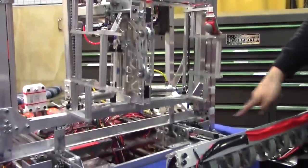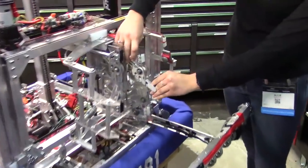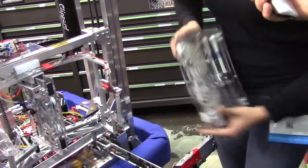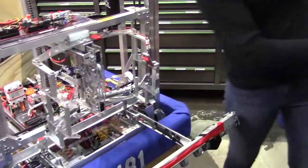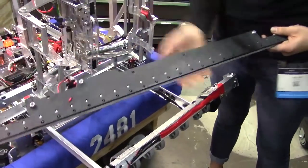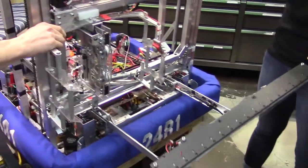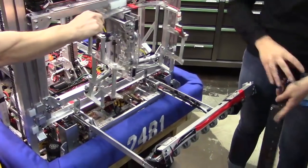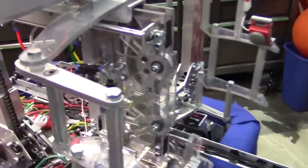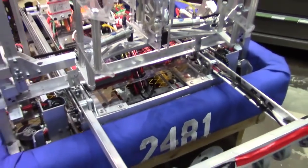This whole manipulator goes up on the elevator and is controlled by our line sensor that extends across the whole front of the robot. So we have our hatch manipulator, which is this thing right here. You can see these gears will flip out and that will grab the inside of our hatch. And then we have our line sensor — these infrared lights shoot out and it detects the line so that this whole mechanism is able to slide about 18 inches back and forth, giving some flexibility so that when we're hit, it can move and lines up perfectly. That's been very successful — you can just see how quickly that is implemented.